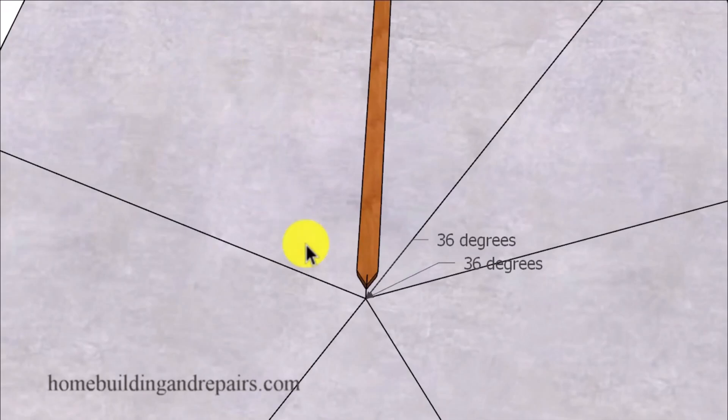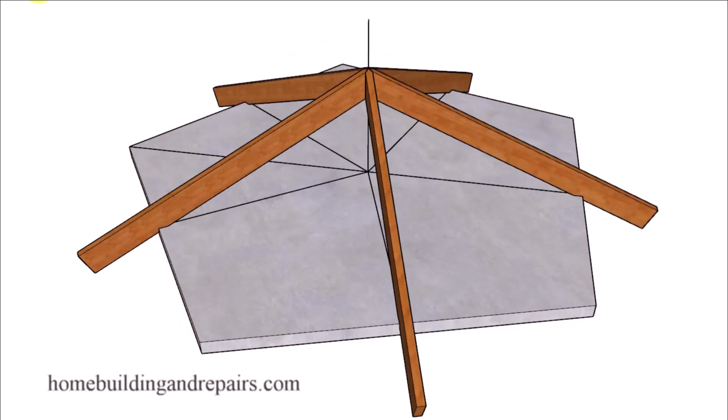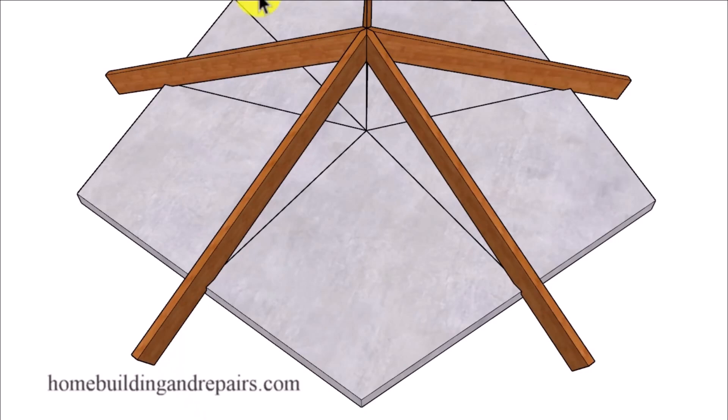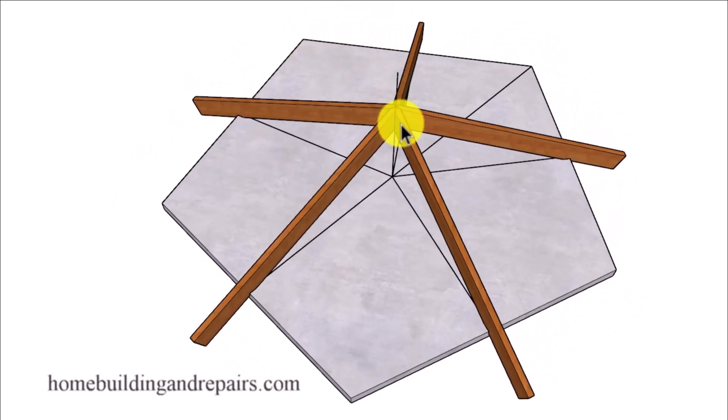Let's take a look at it from the top - this is the center coming up, a level line off of the center. These measurements might not work if you do not have a perfectly shaped pentagon with all of the angles correctly positioned along with equal measurements around the perimeter of the building. This is what it would look like after you cut and installed your five roof rafters. For those of you familiar with simply measuring from point to point to calculate your hip rafter, you won't need to watch the next video where I'll provide methods for calculating hip rafters.